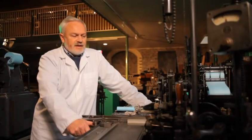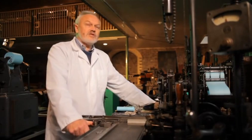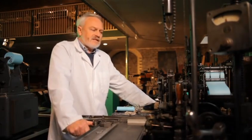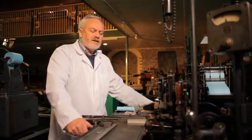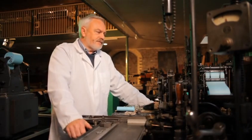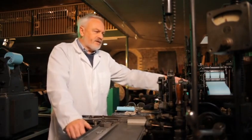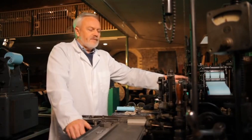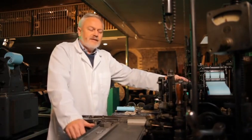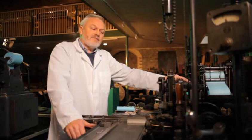They continued to develop the machine. The matrix case originally was 15 rows by 15. They developed it from 15 to 16, which meant modifying and expanding the machine. They changed the gas pot to electric. They widened the air tower to accommodate the extra row. They put in new justification wedges. They completely changed the machine and eventually ended up with what we have today, 16 by 17.